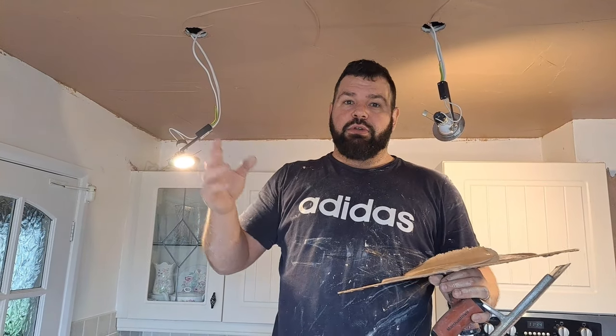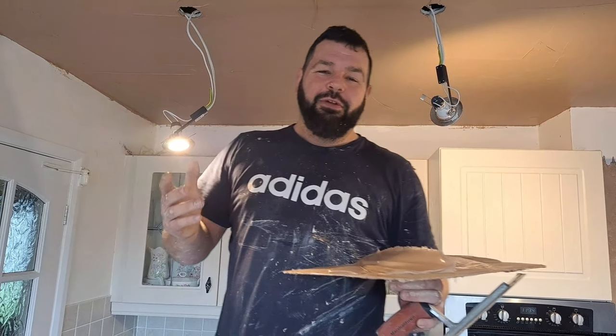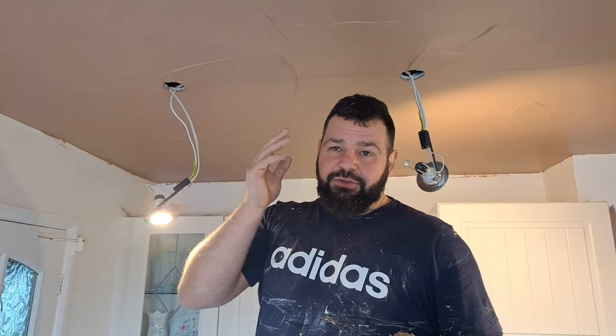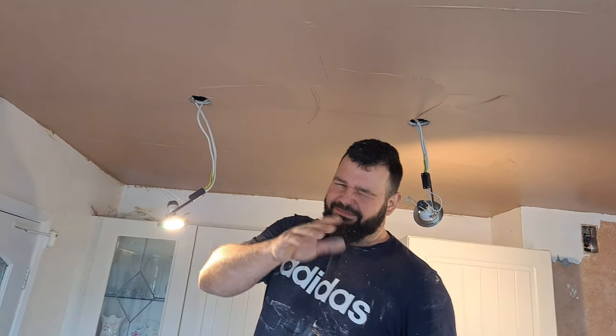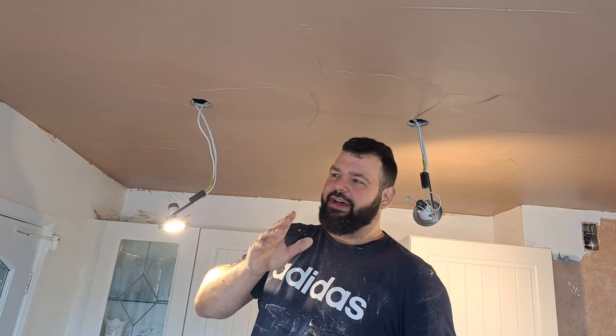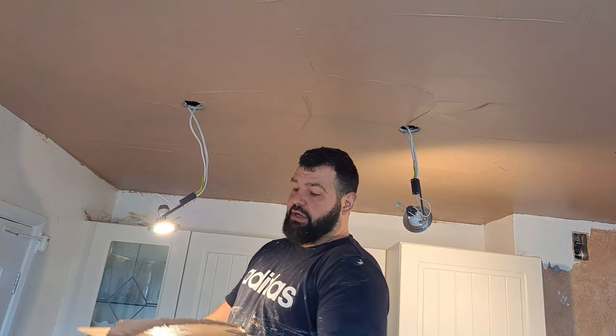You know, you could plaster all. You wouldn't want to. I don't know why anyone would want to do that, but you could potentially just keep putting on all day non-stop, and you know, sort of knock it in the head about two and a half hours before you want to finish, so that you can just try out the last little bits. But you end up just sort of interlocking the mixes together. It can get a bit complicated, a bit out of hand, so I wouldn't go too far at first until you know what you're doing with a rolling set, but that's what we're going to be doing in a minute.